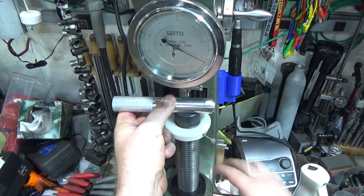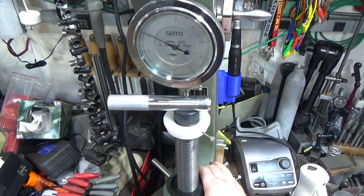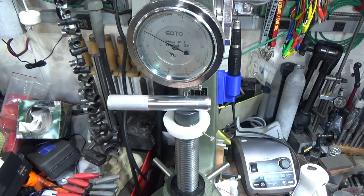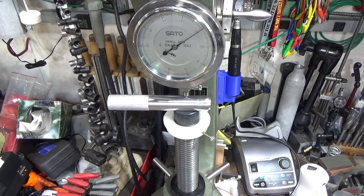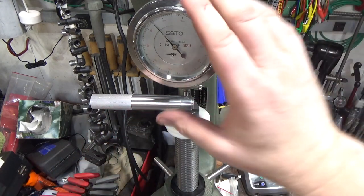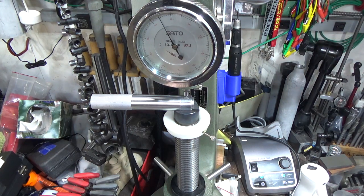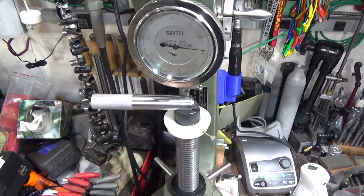Next up, we're going to measure the Rockwell B hardness of all these parts, which they're pretty soft. And I didn't leave a lot of material to do the harder side, or what I would expect to be the slightly harder side, but we'll give it a shot. And that would be 21 for the aluminum in the non-burnished. Using the red scale. And that would be hardness 38.